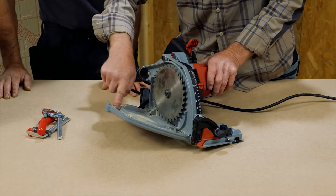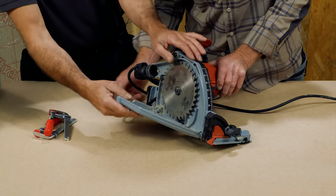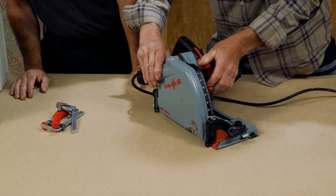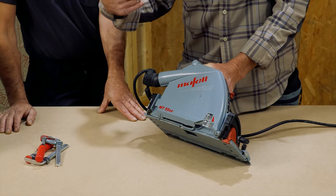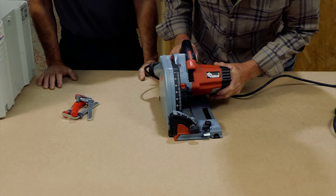While we're here, let's look at the channeling that directs the dust out and away. It's also got a rubber seal around the edge so you get maximum extraction. Having this blade cover closed means you don't have a port in the middle sucking in air — all the air is extracted out with your dust extractor. You can also put a bag on this and it's still pretty effective because of the rubber gasket and concentrated airflow.